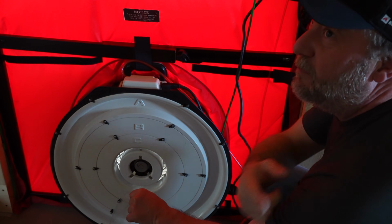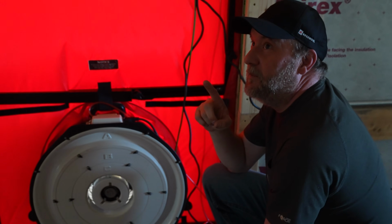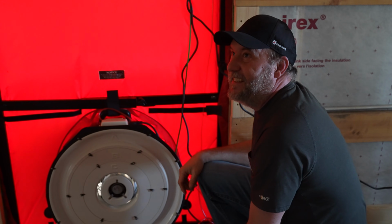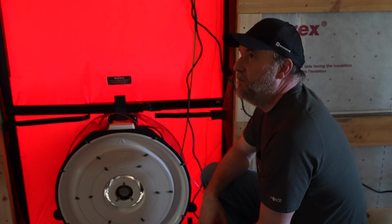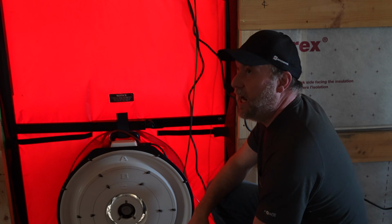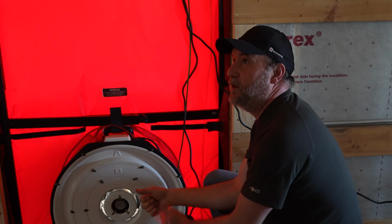Oh, the air's being sucked back in. You know how rare that is? I don't know. I've seen it one other time. Wow. Have you seen it? I have not. So we've depressurized so much that there's not enough air leakage to stay there. It needs to bring air back in to equalize. But normally when you shut that fan off, boom, everything just dies. Everything drops to the floor. With this one, everything's got to go back through the fan to equalize back outside.